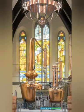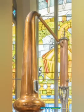We're going to start with the wash still. We're going to fill it up with 2,000 litres of wash and heat it up to 90 degrees centigrade. The alcohol is going to start bubbling, boiling, and evaporating up the lovely long swan's neck. It's then going to cool and condense, and we're going to capture it — that's the first iteration of spirit, commonly known as the low wines, at about 20% alcohol volume, with everything else in there.